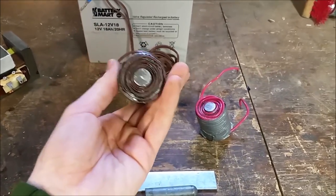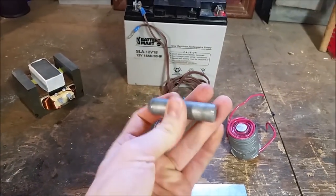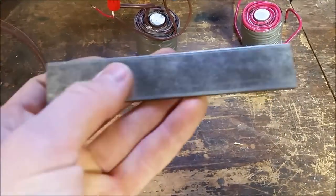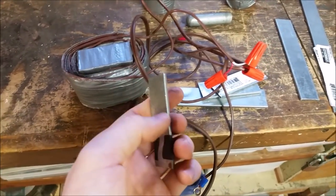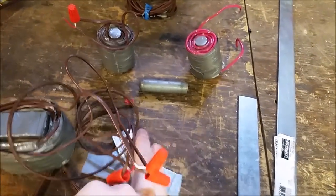The second type of electromagnet you can make uses a core like this — pretty sure it's steel. You can use a solid steel rod, or alternatively you can buy flat bar stock at Home Depot, cut it into small sections, and stack them side by side to create a laminated core, just like in this magnet here. Either way, just make sure it's steel or something ferromagnetic. Whether you use a solid rod or a stacked core, you can create a ferromagnetic core to wind your coil around.